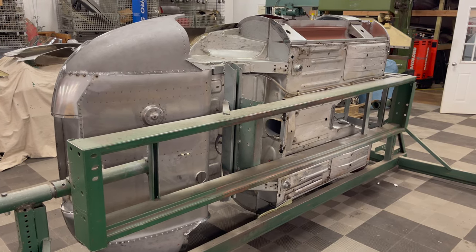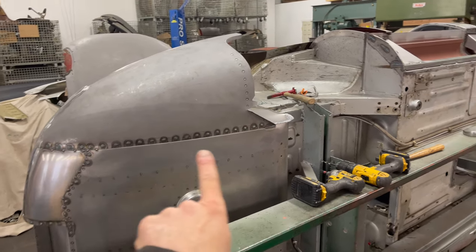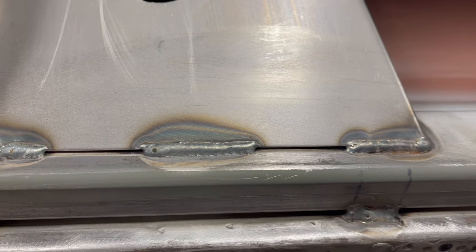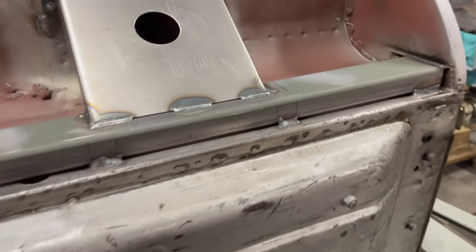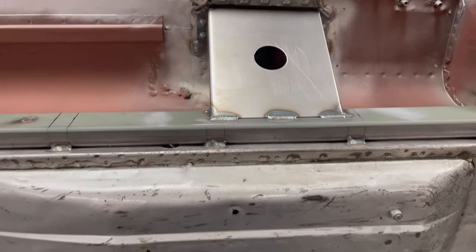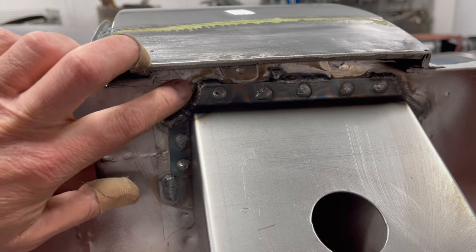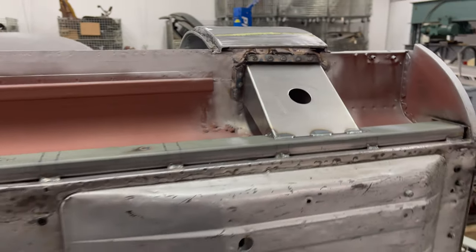I think I've finished welding up everything I need to do on this side. You can see I've got all these plug welds taken care of, and then over here I've finished off these — turned these tacks into little beads. This is why I want to flip it over before I finish this off. There are a lot of factors that go into a weld being a good weld — being able to see it, the angle, and all that. Being able to get right up on this with the helmet and have gravity on your side will give you a real nice weld. You can see where I've used a combination of plug welds and some stitches. It kind of burns in — you can see where it's been wiped off. Time to flip it over and do this on the other side.